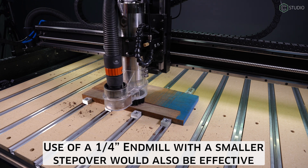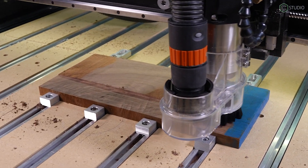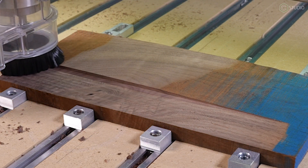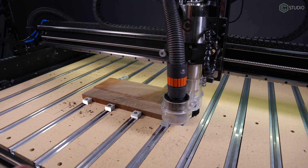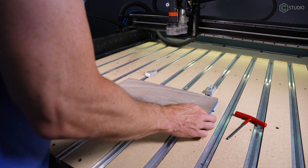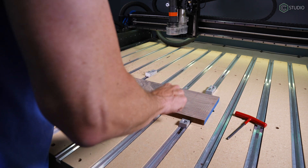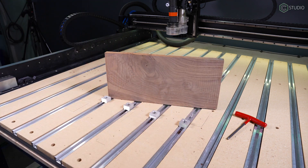Here it is mowing down the other side — five millimeters of cut depth in the middle, and you can see how much dust is thrown off. That is easy peasy for that end mill. I did have a 0.5mm finishing pass, but really didn't need to — could have cut it all at 5.5mm and been done. What was warped and twisted now checks in at perfectly flat. You now know the strategy to make any ugly piece of wood a thing of beauty. We'll see you back here in the studio again with more information, ideas, and inspiration.